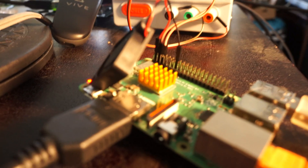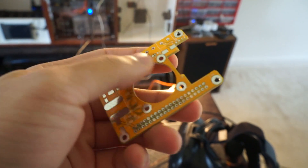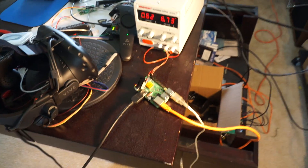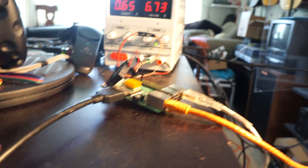The other issue is that the Raspberry Pi itself overheats a great deal when operating these sorts of things, so I'm actually working on a kind of hat for the Raspberry Pi. This is the one I did for the Orange Pi, but I'm working on a new one for the Raspberry Pi so that I can have a hat with a fan mounted right into it along with a power supply. The idea is the Raspberry Pi would be self-contained with the headset, just like I did with my Orange Pi video, but one of the biggest conveniences of the Raspberry Pi is that it has much better software support and way fewer bugs as far as the 3D systems are concerned.